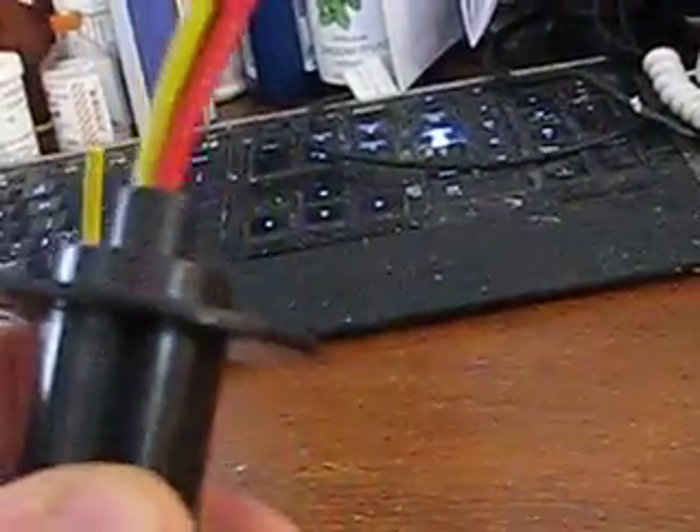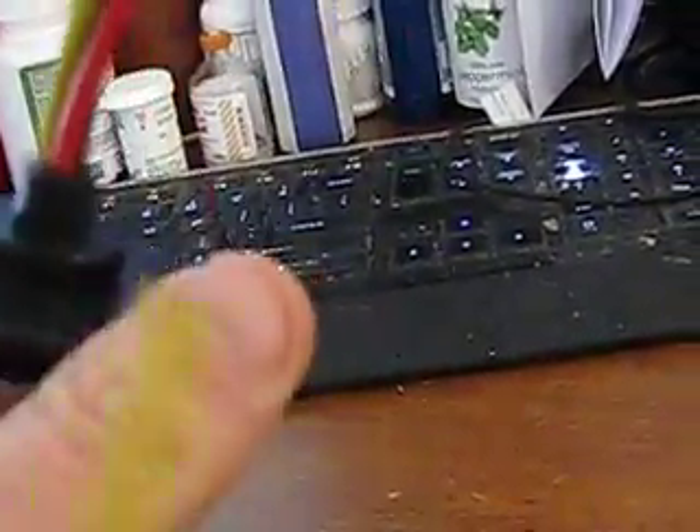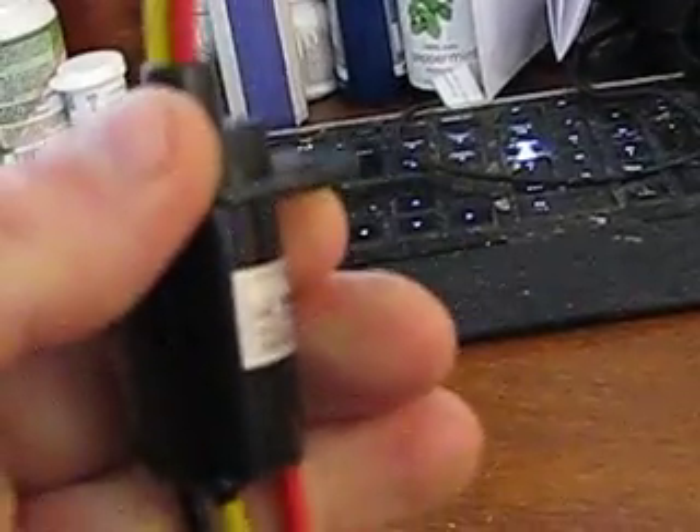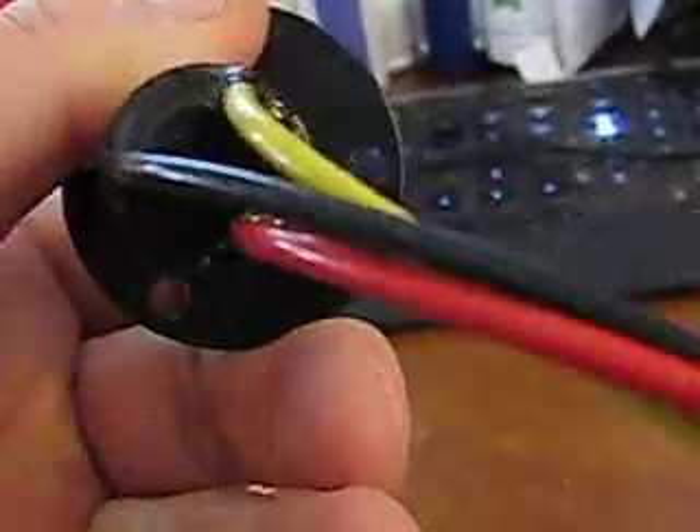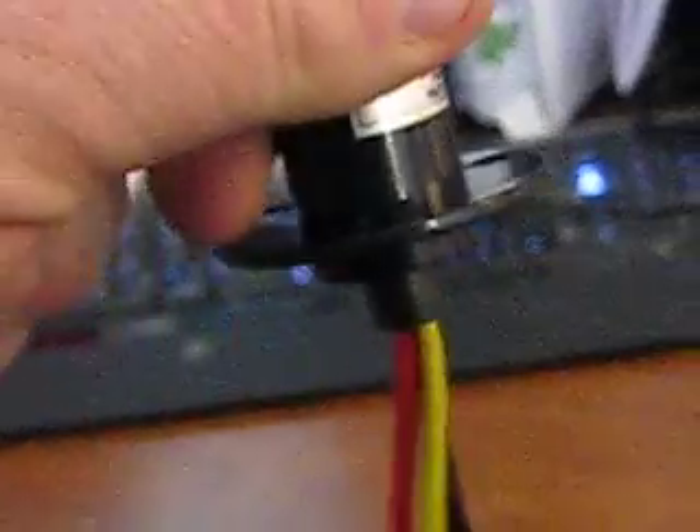What you basically do is attach one end to your turbine and the other end to your wires going down the pole. It spins — it's not cooperating at the moment, but basically it spins. Now, what's interesting about this unit is that you would think you would install it this way, but in actuality the epoxy is right there, so this end goes into the pole.